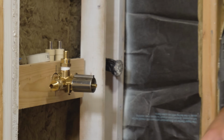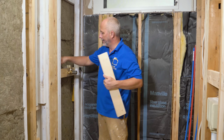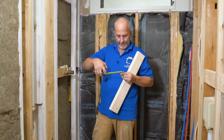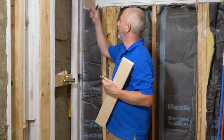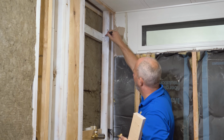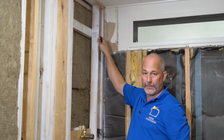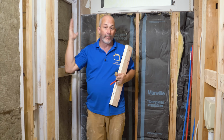Nice and installed. Brilliant. Now, the next thing we're gonna need, obviously, is the drop here. You're gonna find that this depth is, I think it comes out to like a perfect 1 inch. Yeah, okay. So, because it's a perfect 1 inch depth, this material here is actually 2.5. I'm going to add a piece of 2x4 here, and that's 1.5. That gives me 1 inch to the surface. That's perfect because we're still going to be adding our wall board and our tile.